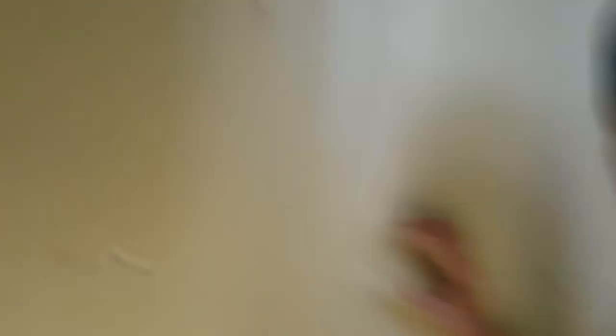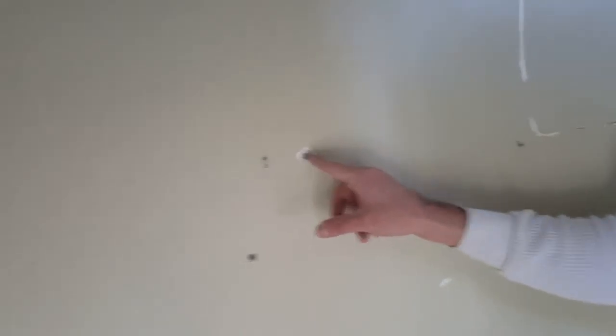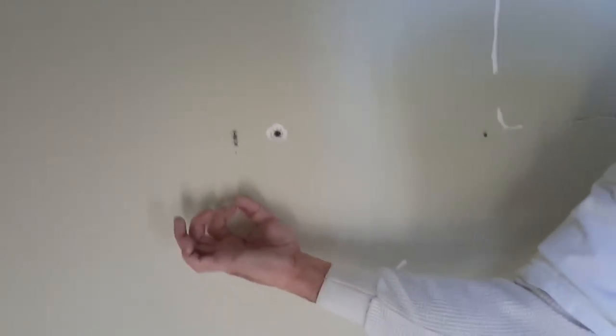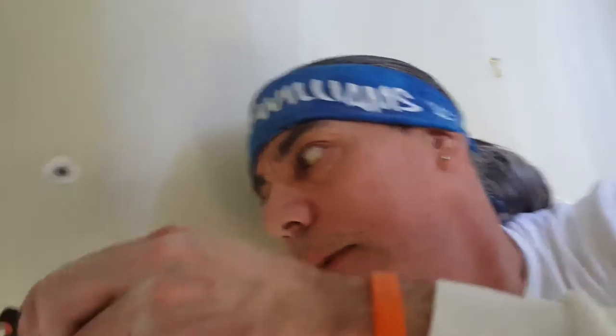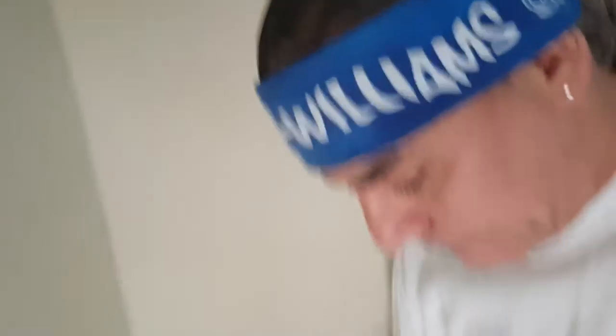Including the walls — all these cracks are open, I'm leaving them open. There are pictures here. You had some screws that were shallow — they're called buttons. You see little round spots suddenly sticking out because there was weight on this wall from a picture. So what you do is grab yourself a Phillips screwdriver and sink them — keep tightening until they sink. You want to put enough material in there and prevent the wall from moving back and forth. That's why it created buttons.